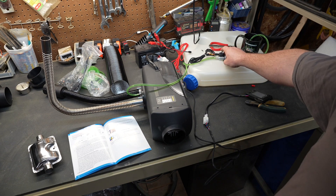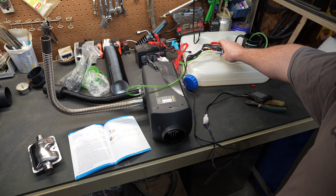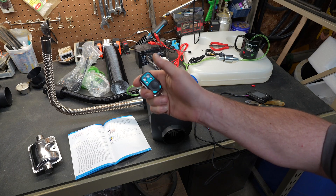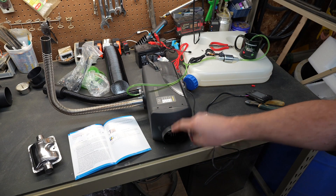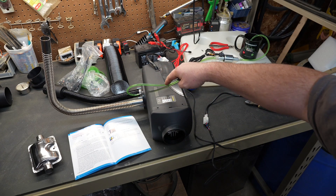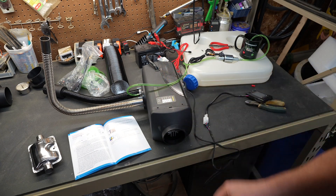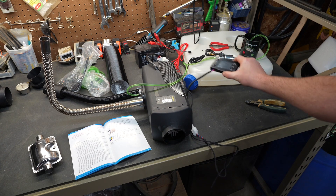The clicking you're hearing is the pump itself — it does get a little bit quieter if you take it off the top of the tank, as it's kind of acting like a speaker. If I want to turn the heater up, down, on, or off, I can do it from this keychain remote. I've just turned it off, but what it'll do is cool the unit down before it actually powers off — it never shuts down completely without cooling the internals down. You can hear it starting to wind down right now. Once the internals get cool enough, it'll completely power itself down. You can also use the panel itself to control everything.